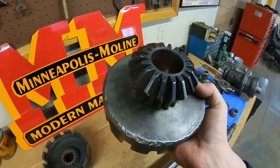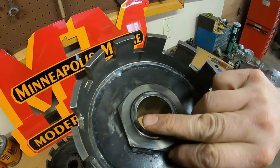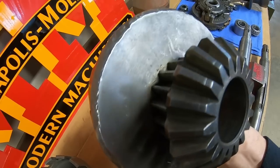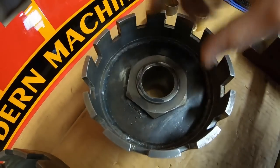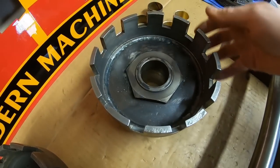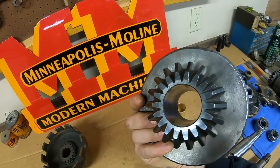The only part of the prototype shell that was not handmade is the gears, and they're fully hardened all the way through to the hub. The way they put this together - they cut all the notches into the back of the shell so that the straight-cut gear portion could pass through, and the top was threaded. They put this big nut on, tightened it down, and then put a bead of weld on two sides of it. That locked the whole thing together, so you'd have to cut those welds to get it back apart.